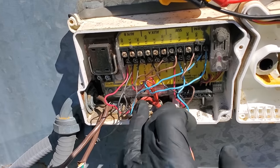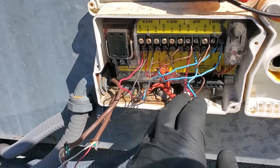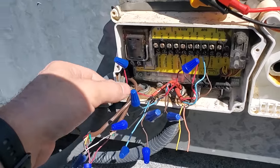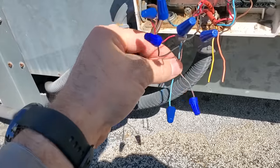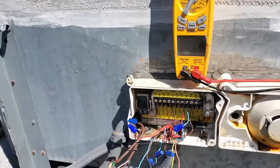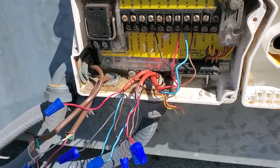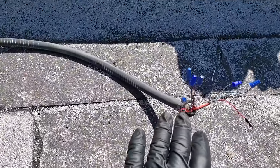I'm going to use their existing conduit — it won't look pretty but it'll work — and then we'll come back and put in a new test and reset station. For now I'm actually going to unwire the test and reset station so we have a functioning duct detector that actually signals the alarm company. Jacket two was power to the detector and the alarm contact; jacket three was also power to the detector and the alarm contact — my assumption is one of these is just jumping over to the other unit. Once I eliminated those wires and marked them, we only have four wires left, and those two aren't hooked up — that's just your test and reset station. When you break them down like that, these detectors really aren't that bad.